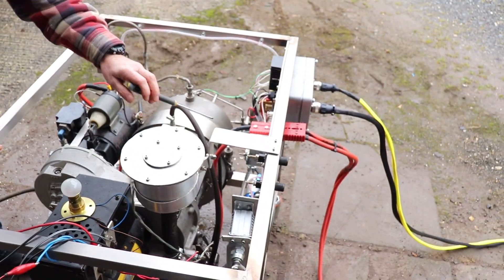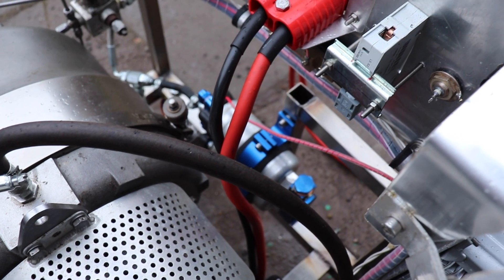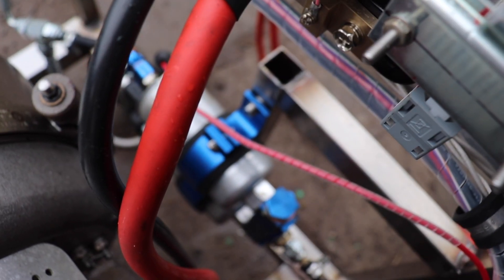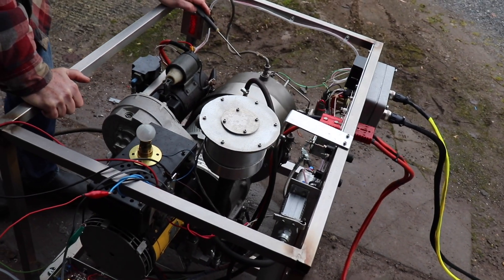So we've shown you the fuel pumps. Also, we've got a DC-DC converter there which provides 12 volts for the two fuel pumps, which are just Bosch 044 sort of fuel injection pumps used on cars. The engine itself is still the same as before - if you want to see what it looks like, there are some earlier videos we've done.